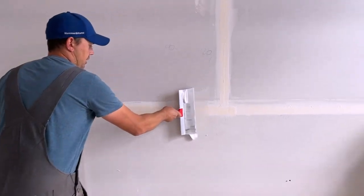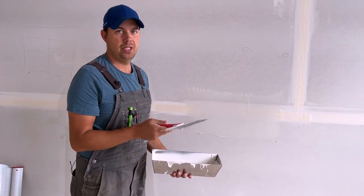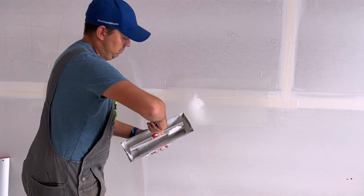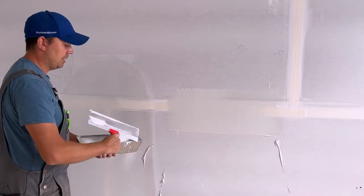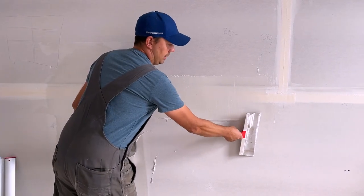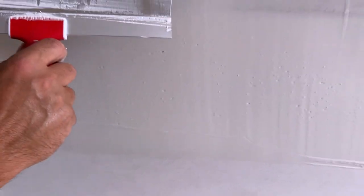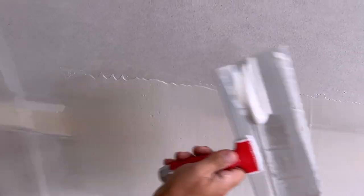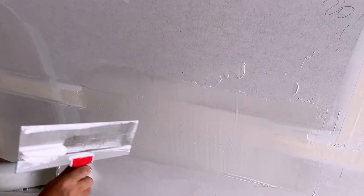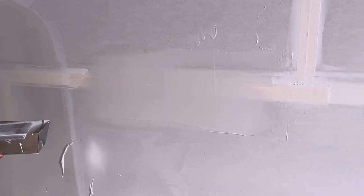If you take your 12-inch and put it on there — just a disclaimer: I would never use a 12-inch on my first pass; I would use probably a 10-inch and then the 12-inch for my final. But just for example, come at it with a 12. Now come at it with some mud — see it's really sloppy, it's dripping everywhere. You can just clean this up just like that. But what you want to do is feather that back. See how I feathered that back? It makes it easier to sand. You never want to leave it looking like this because this is impossible to sand. So you want to push down on the outside and just hit it lightly. A lot of the times I use a six-inch blade to just feather that out — it's a lot easier. Then you can come through and just do that, and that's ready for sanding.